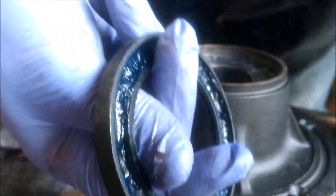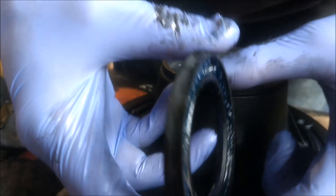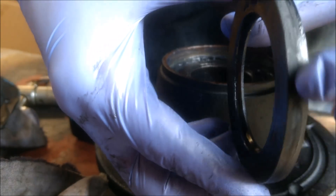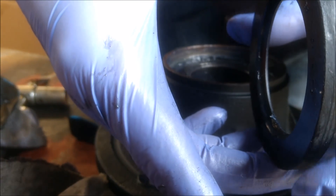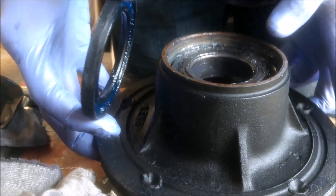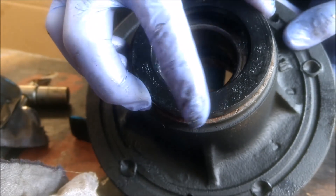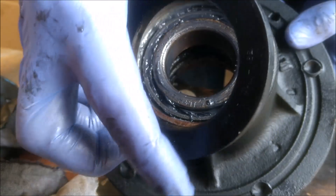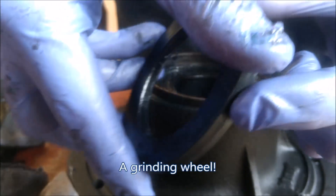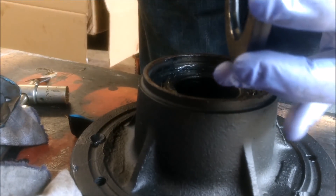Now I had an issue with these seals. You can see on the side how it's a little bit scuffed. What I needed to do was take off some of this rubber — or plastic, whatever you call it — and trim it down because the diameter was actually too large for the opening. It was about 0.5mm too large, so it was sitting above and I couldn't press it down. I actually ruined one of these attempting to press it down as it was — I think there was a bad batch. So I had to take a wire wheel and just trim off the edge until I got it all nice and even.